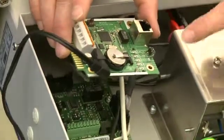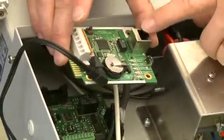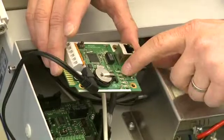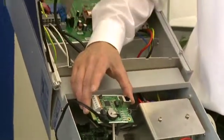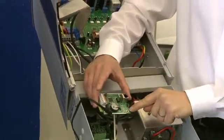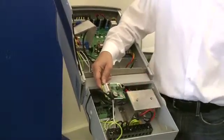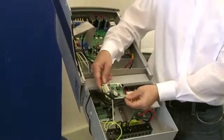Now we know that there's no internet connection and no link connection — there's no connection to the router. Even if you have a cable in here and the cable is just wired wrong, this will probably show up. Sometimes the link light shows because the cable is almost connected correctly, but there's one pair that's twisted. That means you have a connection to the router and voltage, but the COM light will still blink. In this case, you know you have to check your wire — use a master link tool to check if the connection is correct, and then run the cable new.